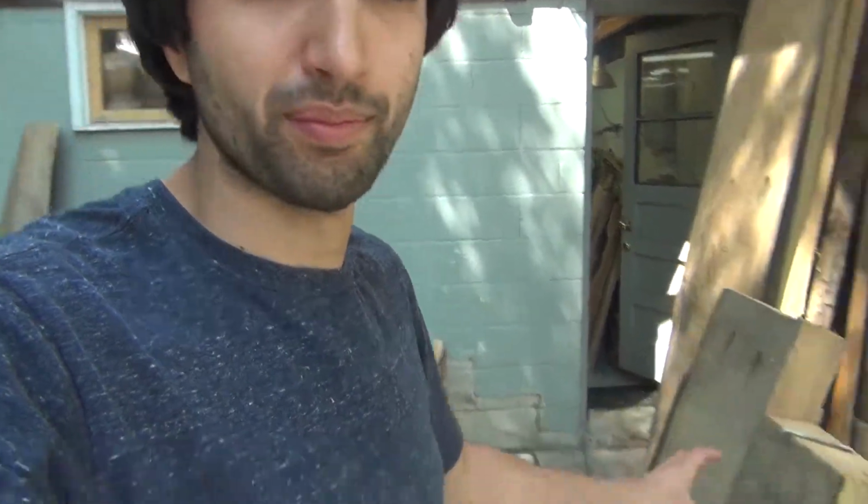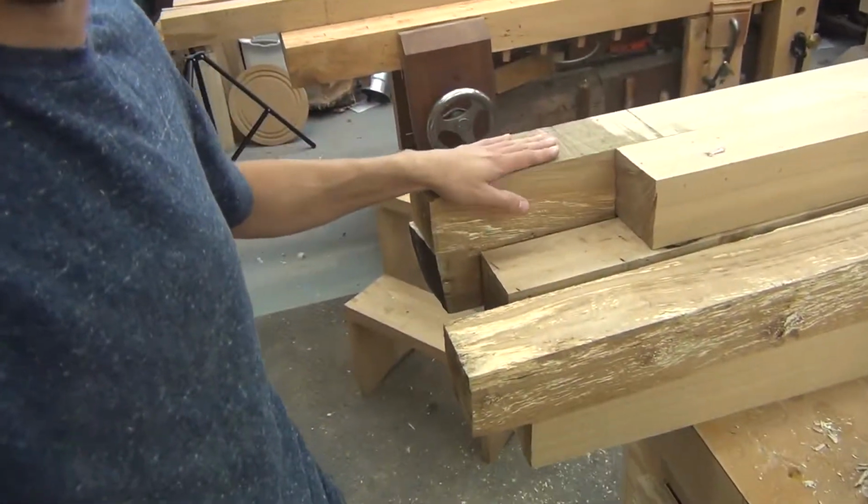So instead, what I'm going to do is mill up the breadboard end stock, so I have that ready to go. I have to resaw it out of those pieces, and then I also have to finish milling down the base stock. It's like a 1/16 of an inch too big right now, or I can take it down a 1/16 to get rid of some more of the roughness on some of the boards that aren't fully surfaced yet. So that's what I'll probably end up doing today. I finished up a couple vlogs and my chainsaw repair video this morning as well, so I have those going out soon.